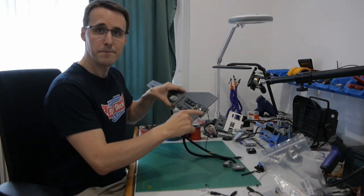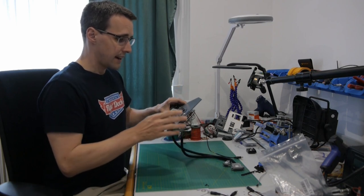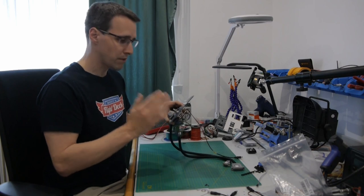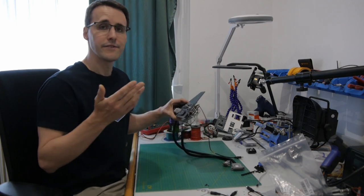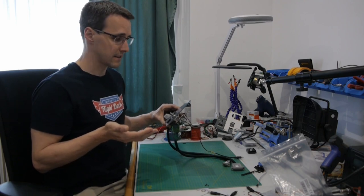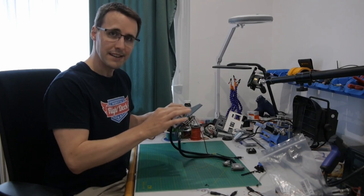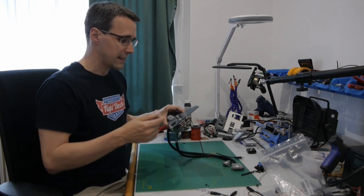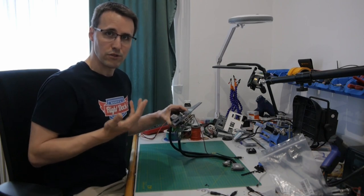This black plate here at the light test switch, I have made this plate from 1mm polystyrol that I have painted and engraved. If you don't have this material, then you can also change the design a little bit, like all the other switches on a panel, and you can make this from normal 3mm acrylic.